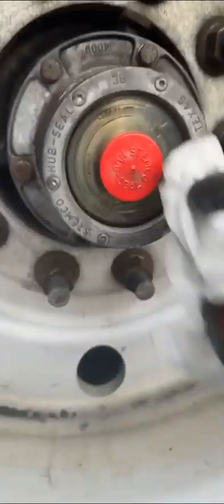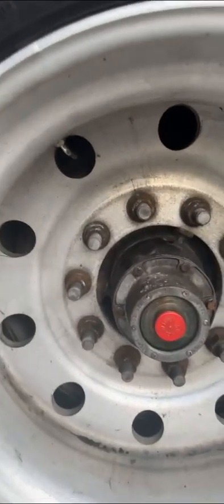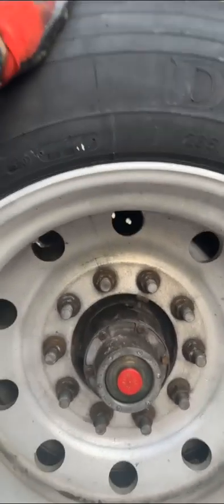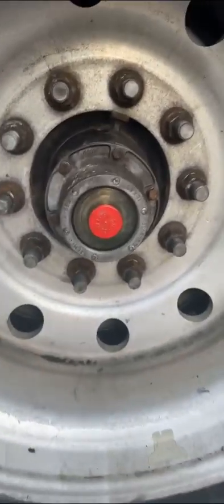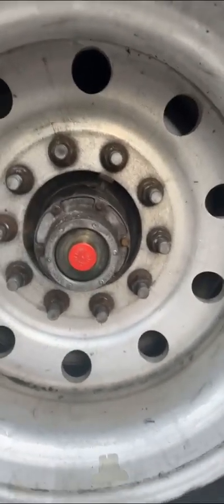You see — the oil already went down, I'm gonna add more. I wanted to get out of doubt so I put the tires on first. Then I do the test everybody does with the bearings — and I think these bearings are shot. That's the whole reason the seals have been going out. They wobble, which is strange because the American brand usually lasts 400,000 miles. This one only lasted 100,000 — I'm gonna buy another one and send a complaint.